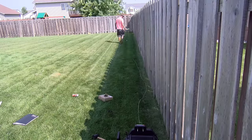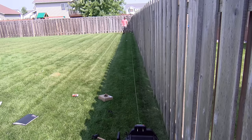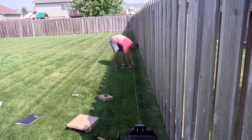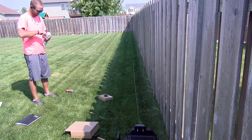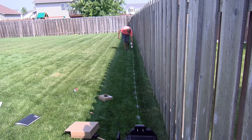Here's a pro tip, so pay attention. We used some mason string to run a tight line from one peg along the fence down to the corner. We checked the distance of the string with our marking gauge and made sure it was at 14 inches, and then we used some marking spray paint to paint a line over the mason string. We actually improved on this method, so stay tuned for a little bit of an improved technique.